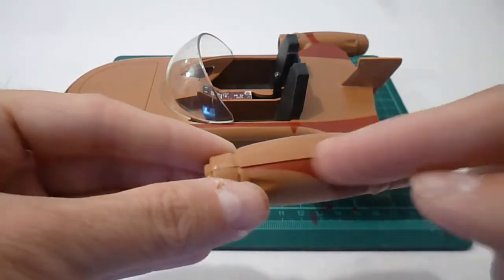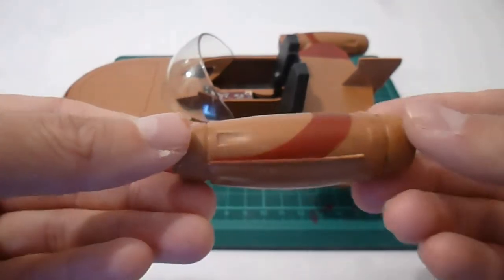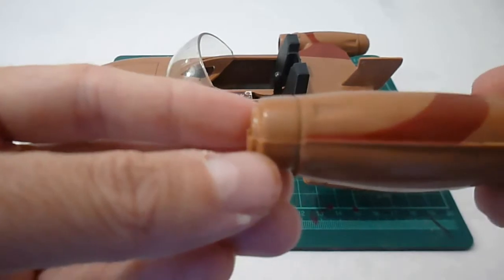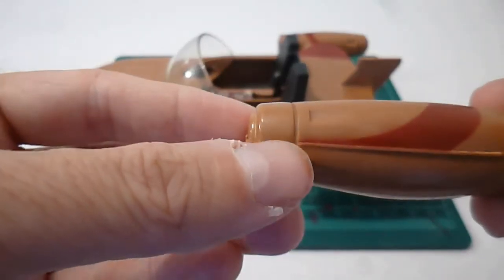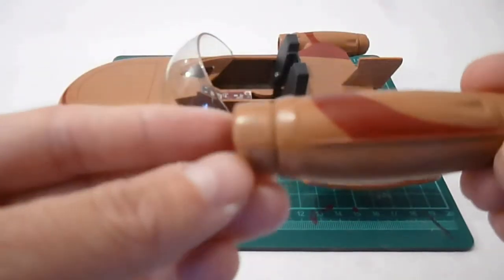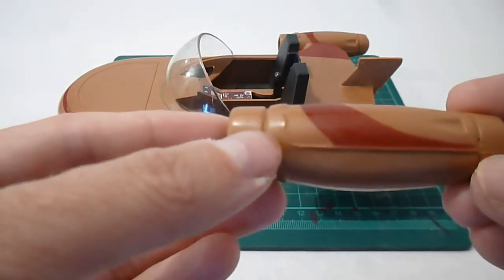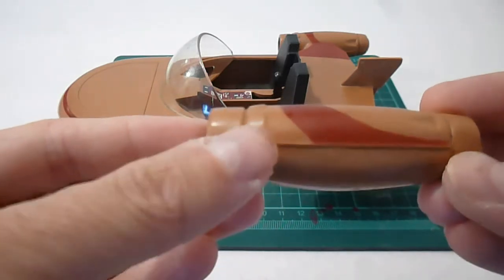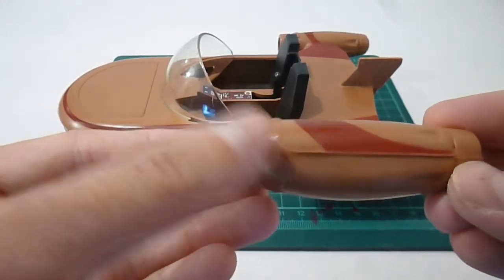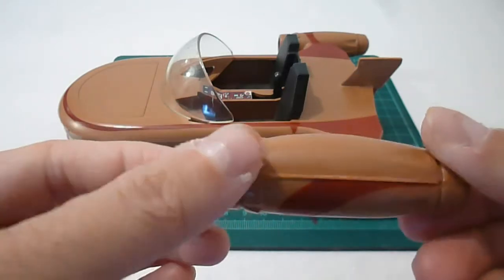I've just roughed it up a little around the edge there to make it fit in with the original patina, how it was before. As you can see there, the milliput was in that little gap there where I cut into it. So that's sort of sanded in now. I put a bit of gloss over it to just shine it up so it doesn't look dull.